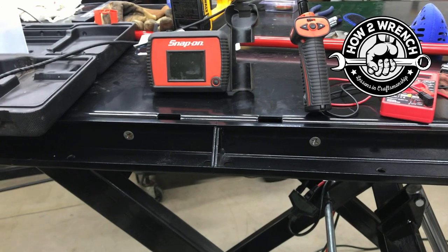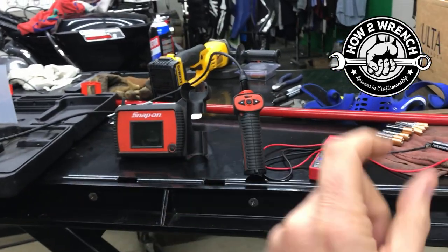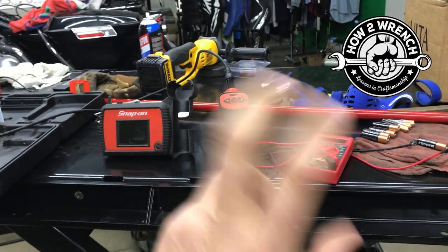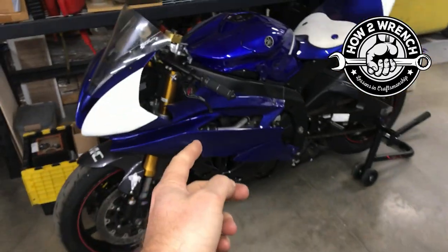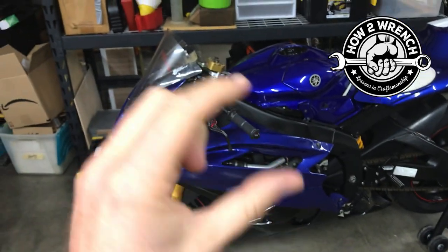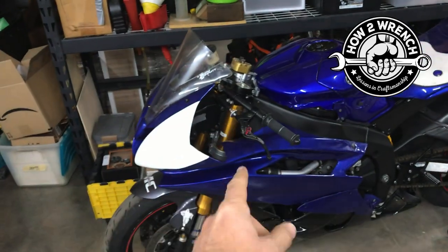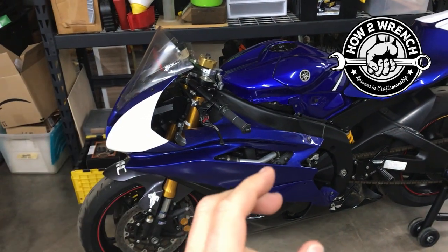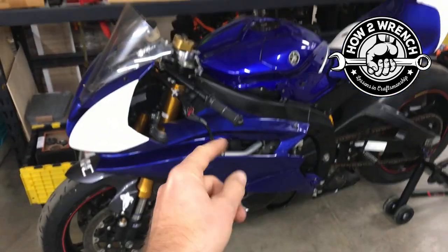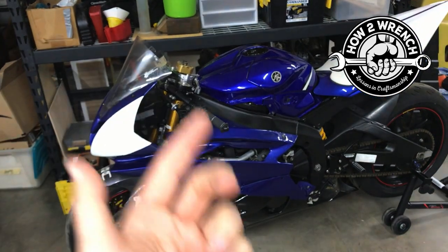I'm going to put a link below in the video of a temp gun video where I took a new battery, a weak battery, and a bad battery, and you'll see the results of how different the temp gun read. If I was comparing that temp gun to, let's say, a sensor on the motorcycle that I have to heat up with a heat gun and watch the resistances move around or something, and I'm using the temp gun as that basis to determine if the sensor is good or bad, well, if I have a bad temp gun reading, it's going to tell me my sensor's bad. And then it's just this vicious cycle of replacing parts that aren't actually broke because I'm not testing them accurately.